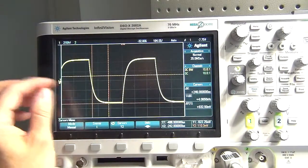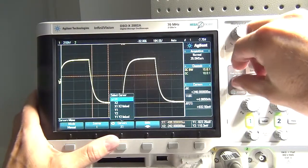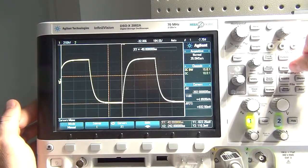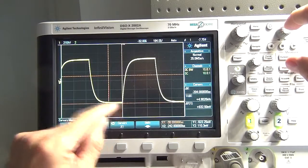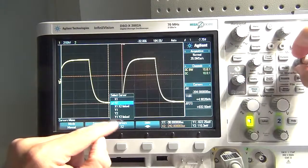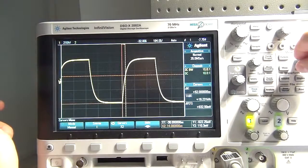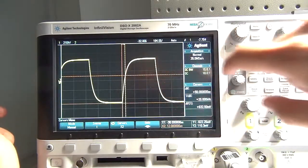So now we're going to start fiddling around on the time axis. What we need to measure is to change the X. We'll do X1, and I'm placing that right at the foot of the wave. I'm obviously only using my eyes. I could zoom in if I really wanted to, but it's fine, I'm quite happy I've got it there. Now I'm going to select X2, our second cursor, and take it up to where it intersects with the wave, right over there. So let's have a look. And I think I've got it on.